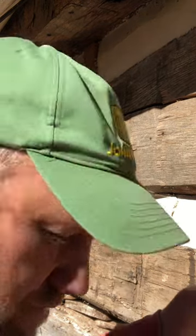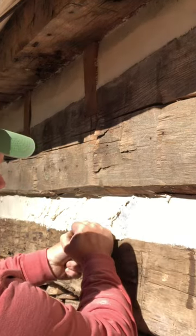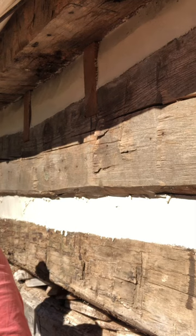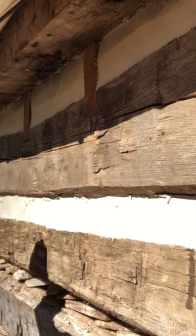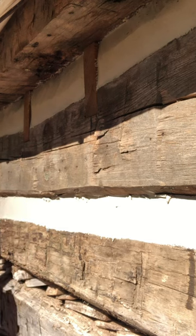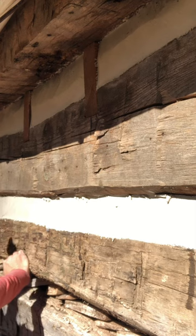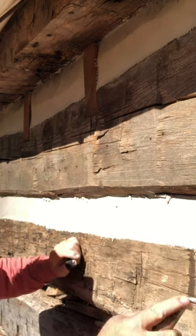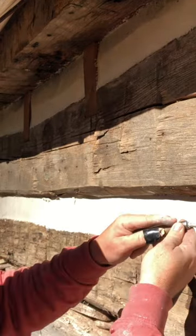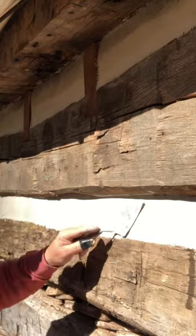Loaded in there, come back across on this heel right along that bottom, pushing up and in as you go. Smash that stuff in one more time right into your block. Continue that all the way down your joint, following that bottom edge. It may pull away at the top, and that's okay on that pass. Then we'll come across the top using our tip and this edge. Let it follow it. It'll pretty well create your hole.